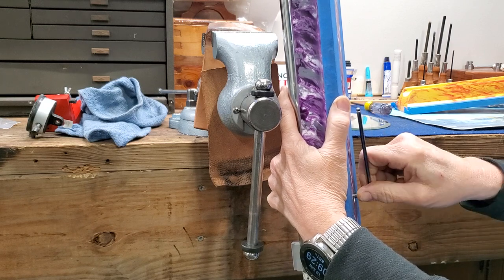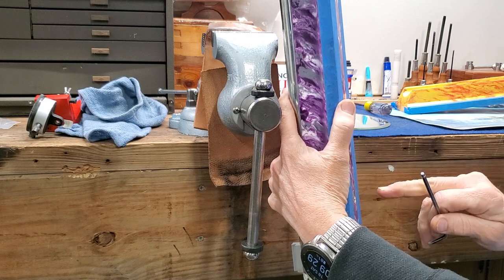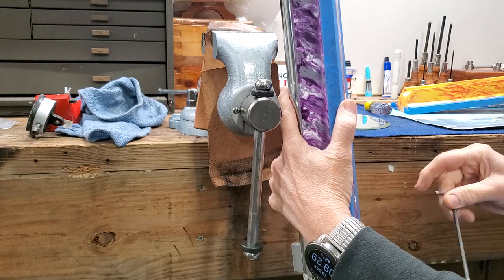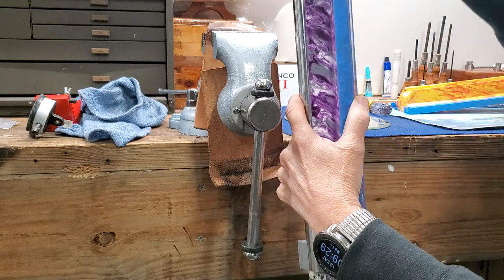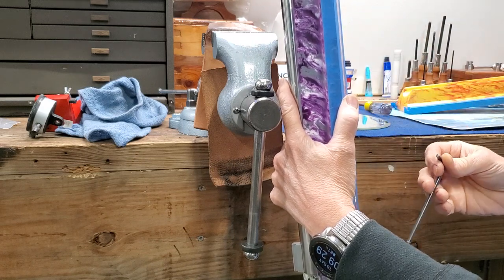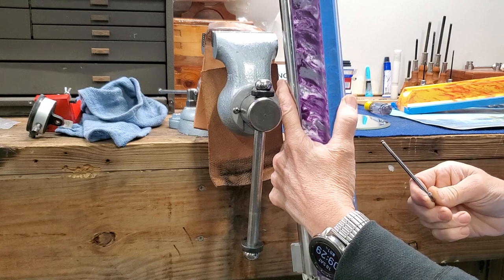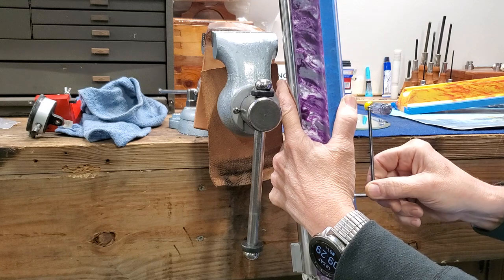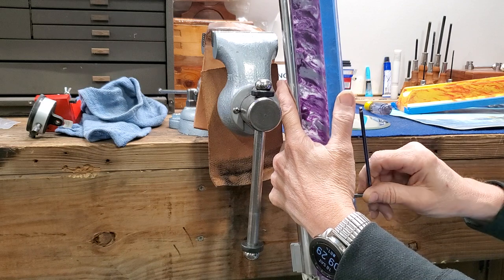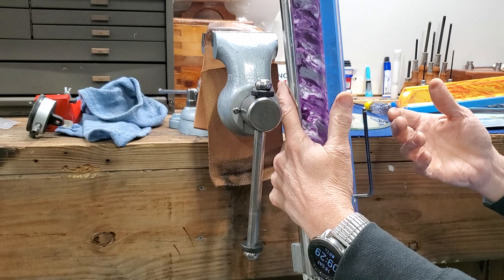And I'm going to add to it. When you break it loose and you're testing, hold that thing. Guys test it. I've heard people holding that barrel, feeling it, and tightening the screw down. If you feel movement, you definitely got a problem. But I personally have a hard time feeling thousandths of an inch. And there's a lot of discussion on what's allowable and what's not. I personally just believe if I can get zero, I don't have to worry about it, do I?